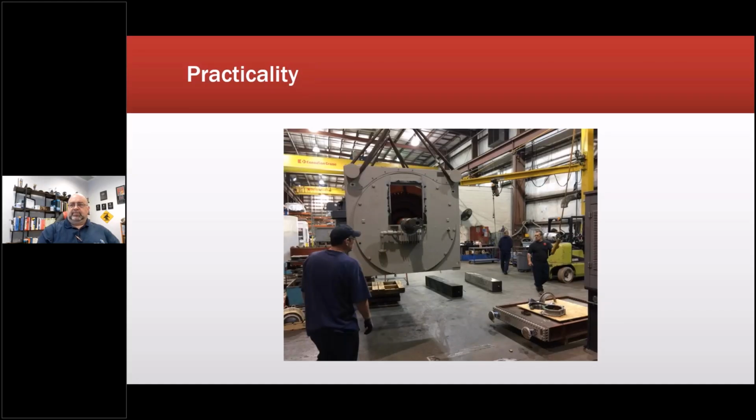So this is the repair shop. We need to be there during the teardown in order to identify anything that's unusual. I just won a court case on behalf of Phillips 66 by just doing this. We had a pipeline issue where all the manufactured 4160-volt motors run off VFDs had the leads coming in. Once the leads had penetrated into the motor, and the bearings were lubricated with turbine oil and the breathers and everything, all the rubber inside the machine was actually rubber. It wasn't insulation material. It was a knockoff, basically, of actual insulated cable.